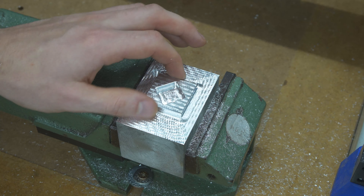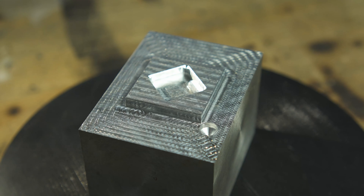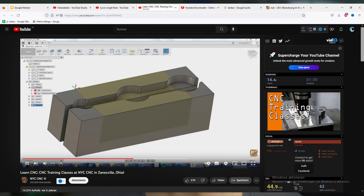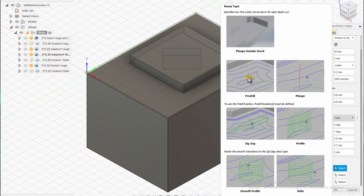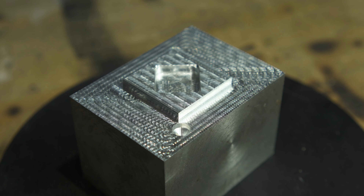So the pocket is a little bit undersized, but everything else came out really nice. After this adventure I had a deep dive into toolpaths on semi-rigid machines, and I have to say there is quite some room for improvement on my side — feed optimization, smoothing, ramping, and spring passes, which all help with chip load and deflection. Since my initial plan was to build a mostly printed CNC, I have to say for my needs this machine is more than accurate enough. But with optimized toolpaths you should be able to hold 0.05mm tolerances without much fuss.